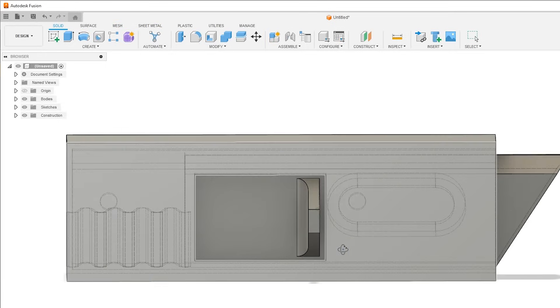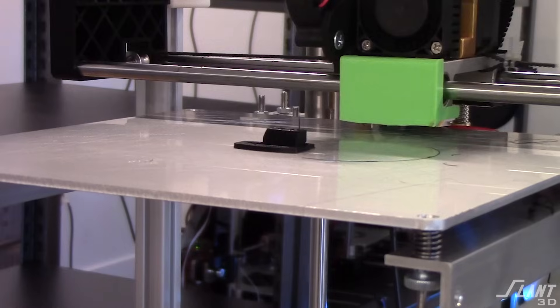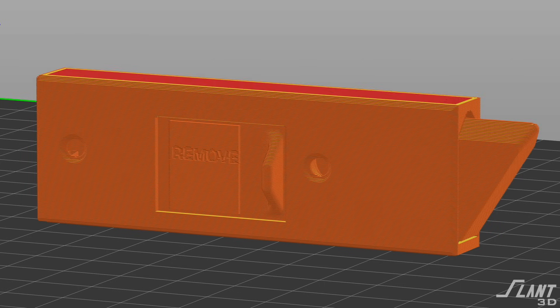We're able to have the handle sticking out the side and integrate a spring. Now, the spring is interesting because normally it would come in from the side and would wobble in that direction — that's how you'd shoot it inside a mold. Since we're using 3D printing, we're going to print it up on its long edge. This ensures it's easily knocked off the machine so you can produce hundreds of thousands affordably. Laying it flat causes auto-eject issues and smoothness problems with the latch, so printing on that small side creates a much more reliable and manufacturable print and ensures interior mechanisms align correctly.